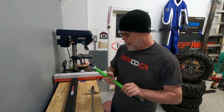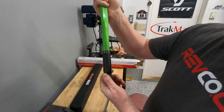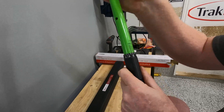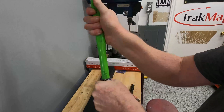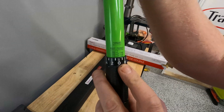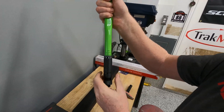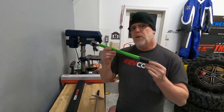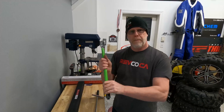One important thing with these torque wrenches: how you set the torque is by turning this handle. Let's say for tires you want to go to 100 foot pounds — you go to that measurement on the scale. If you need 102 foot pounds, you adjust it to 102. Very easy. With any torque wrench like this, when you're done with it — and this is an error many people make — you have to loosen it and put it back to zero.